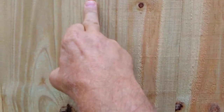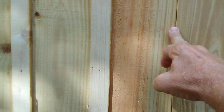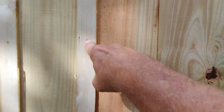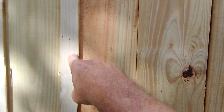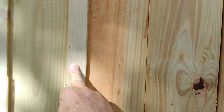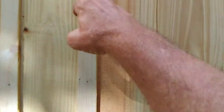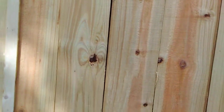I don't worry too much about the gap because the strip is going to cover it. This one is much tighter, but I'm putting them on with finishing nails — 4d inch and a half finishing nails. I'm putting the nail right in the seam so that the batten is not attached to the boards. That way the boards can expand and contract behind the batten. This is roughly a three foot strip gap I'm having to fill, and I've got four finishing nails — that pulls it up good and tight and fills in the gaps.